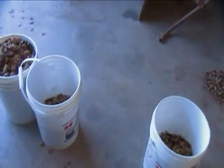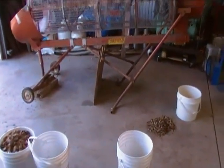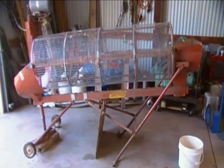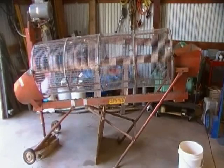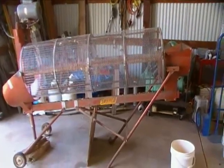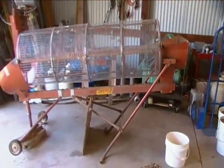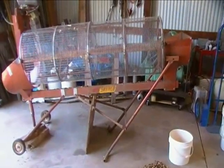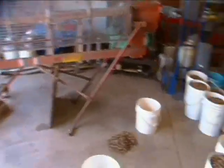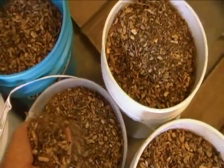I think what I'm seeing — and time will tell — is that when I was feeding the wood chips, I was feeding them pretty fast. What's happening is, during the tumbling process, if there's too much material in there, the holes get plugged by a bigger piece when a smaller piece goes by, and it doesn't get a chance to fall out. So I'll have to try changing the feeding rate, watching it closer, and smoothing it out, rather than just dumping a whole pail onto that first set of screens. We'll see in the future whether that makes a difference.